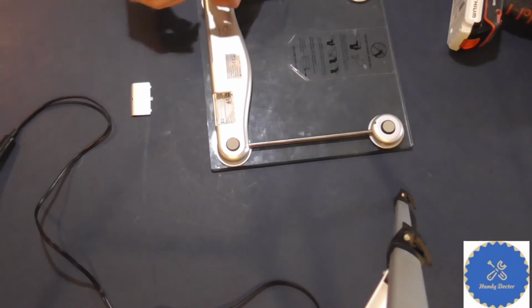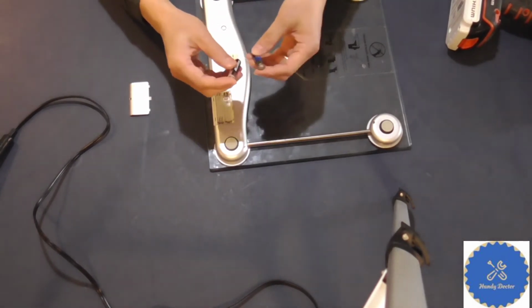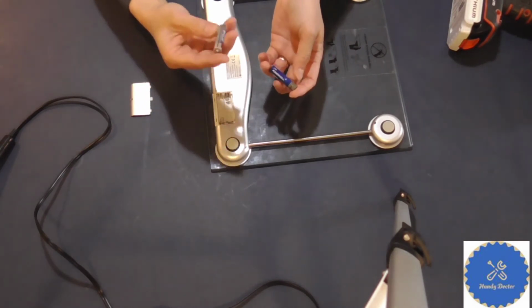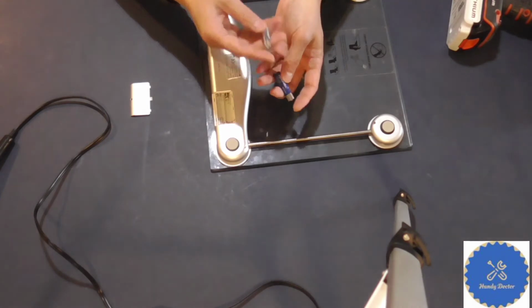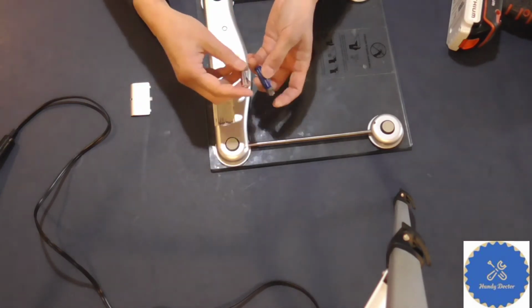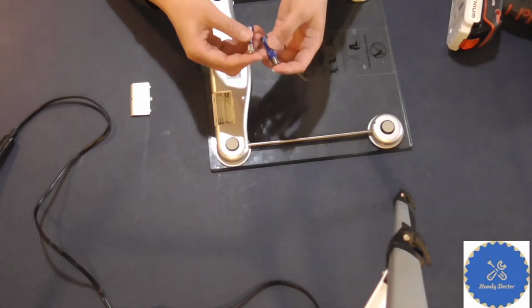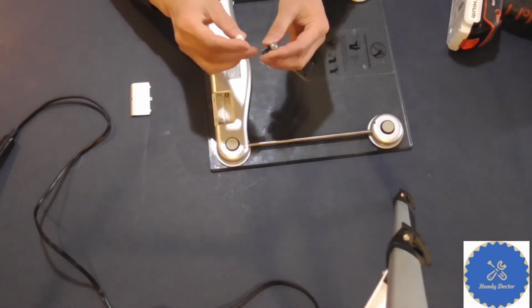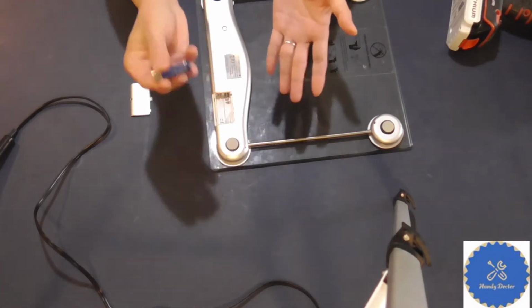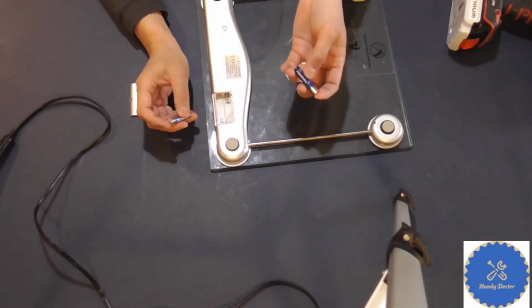First thing first, you need to find out how the batteries are connected with each other. When there is one, that's easy. You know, AAA battery, AA battery, or even C or D, they're all 1.5 volts. But when you have 2, what's the relationship? Well, most of them are in series, meaning that the total voltage would be the sum of all those batteries. In this case, it would be 3 volts. But you need to find it out first.